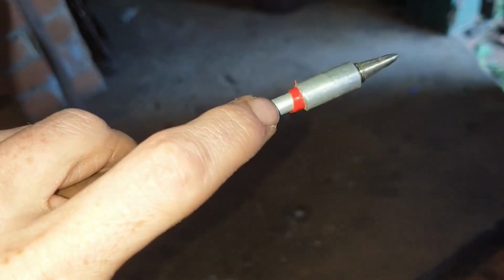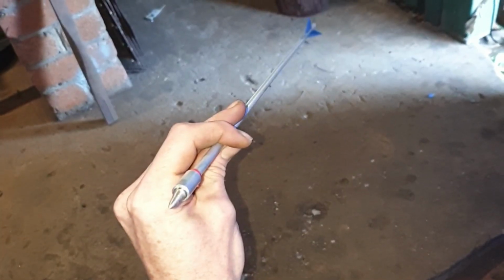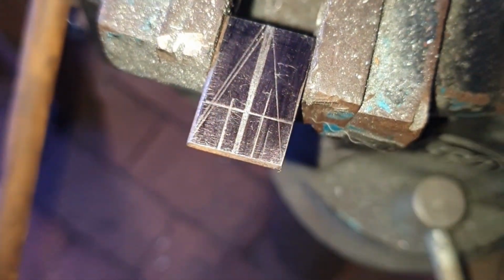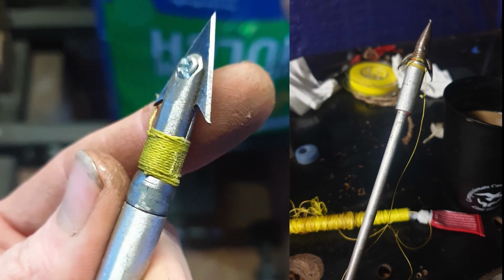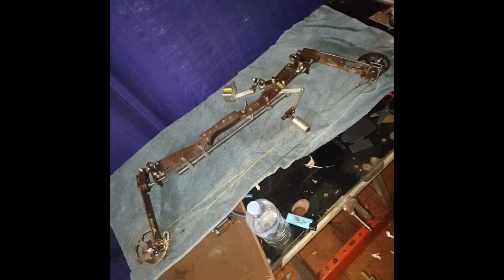Also, a part of the R&D is working out the best way to attach arrow tips. This is the big downside to solid aluminium shaft. No internal threading means that a bulky collar is required. I tested a variety of tip connections, but honestly, arrows are a tricky work of art, so no great solution was found here yet. I'll have to keep researching and developing arrows in following videos. So I moved on to more tests.